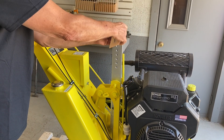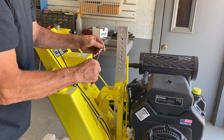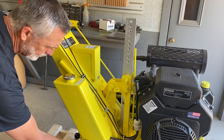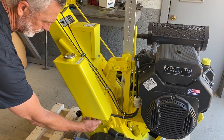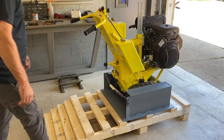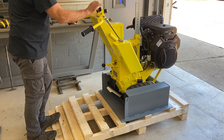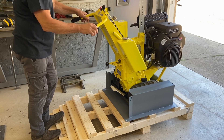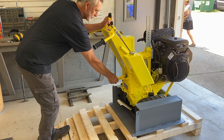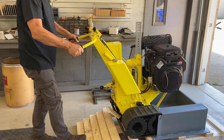As we move to the L2 itself, the ignition keys can be found attached to the top of the blade, along with a tag indicating the fuel shutoff valve. After constructing a temporary ramp, remove the safety chain on the transport carrier, start the L2, select the reverse gear, and carefully back the unit off of the pallet.